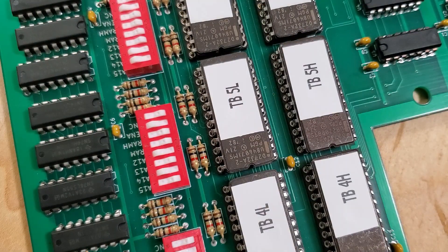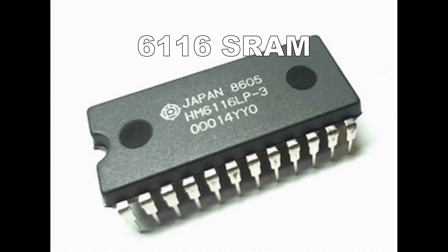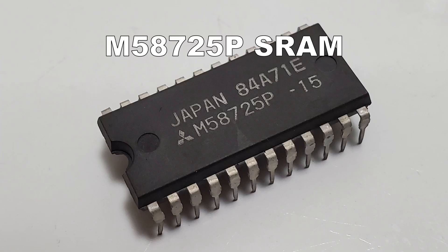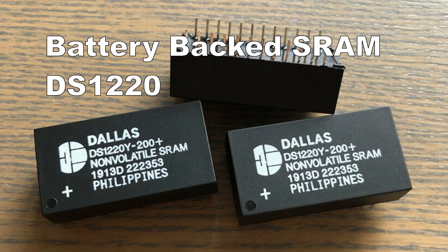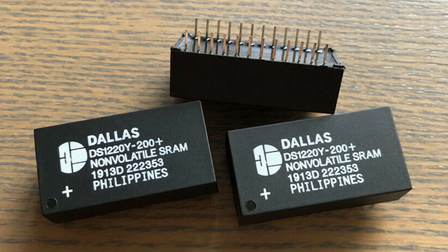To give some examples of supported chips, ROM code can be stored in Intel 2732-compatible EEPROM chips. Supported SRAM chips include the 6116-compatible chips, such as the Mitsubishi M5872-5P. If you're interested in long-term data storage such as game save states, then battery-backed SRAM can be used, such as the Dallas DS-1220. If you have concerns about battery leakage, then theoretically FRAM can be used as an alternative, although it may be tricky to find or adapt modern FRAM chips to the 24-pin socket. It should be mentioned that long-term data storage for game save states only works if the game was coded to support that feature — merely installing battery-backed SRAM is not going to magically add saving game data for original Intellivision games such as Astro Smash.